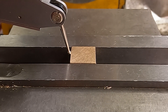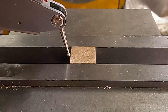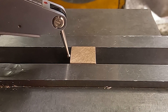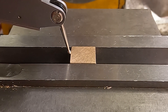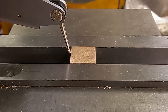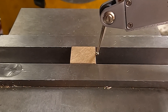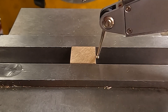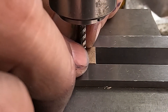Here I'm using the dial indicator to find the X center because it's just too much of a pain to mount the wiggler in this position. I would have had to take off the 4-inch extension, take out the mill cutter, lower the speed to something sensible because we're running at 3,000 RPM and the wiggler doesn't like that, and then reverse the whole process after I was done. So it's easier to use the dial indicator, which is just held on with the mag base to the 4-inch Morse extension.